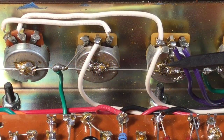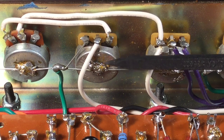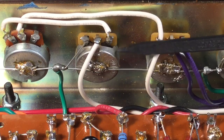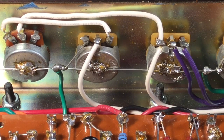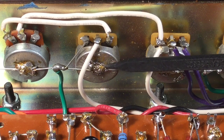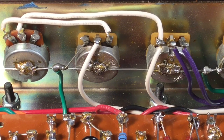Here's an example of not necessarily cold solder, but when the soldering iron wattage is too low you get this effect, so we're going to fix all of that. If you're starting out and you're trying to solder these larger components and you're seeing something like this, it just means you need to get a soldering iron at a higher wattage or a variable temperature type. You can usually get a pretty good wattage if you purchase something from Hakko or some other high-level manufacturer.